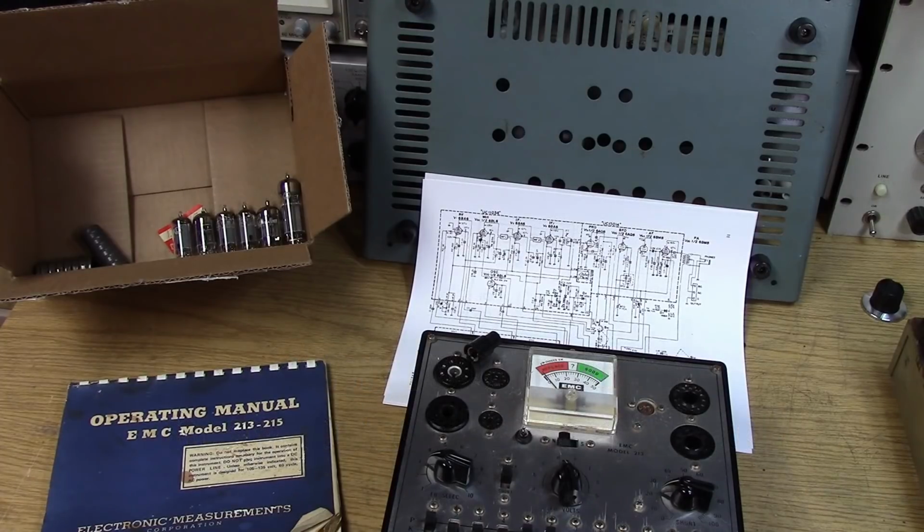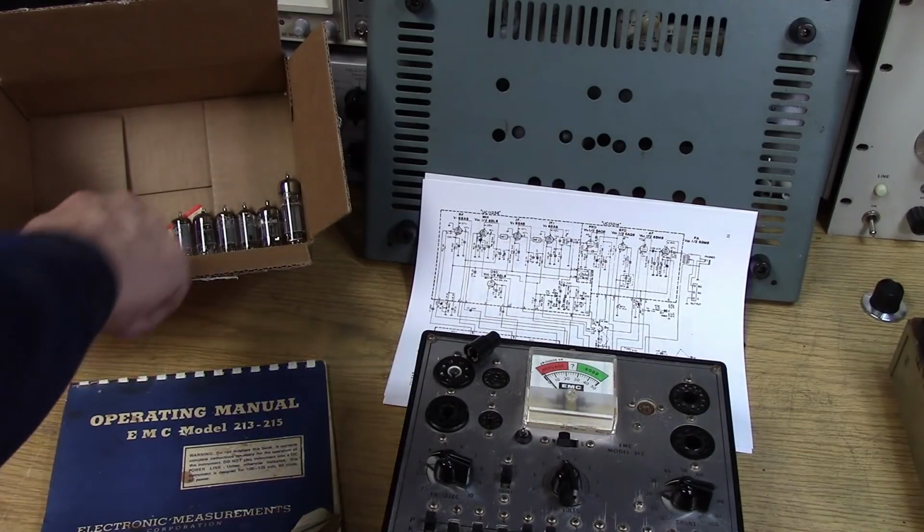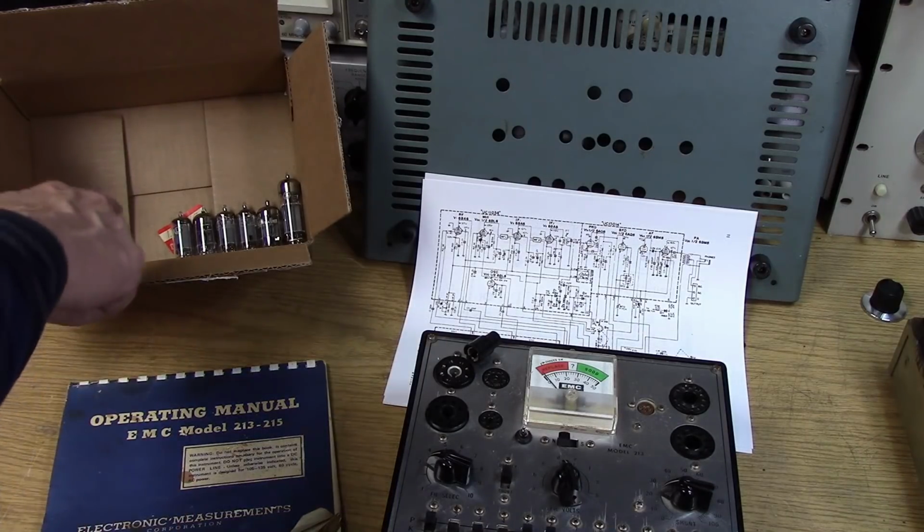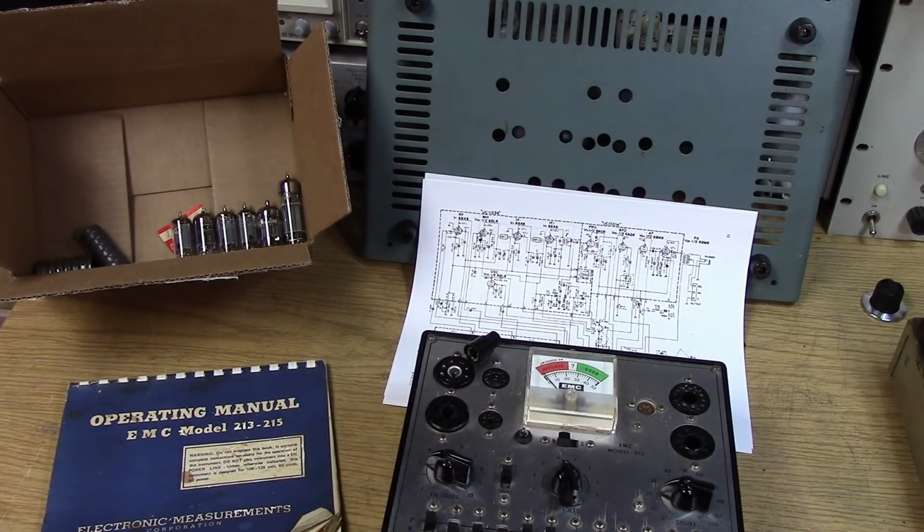But one thing I noticed as we go down the line here, and we have the RF amplifier and the two IFs, are 6BA6. But the 6BL8 frequency changer, which is a mixer and an oscillator, has been substituted by a 6GH8, which is similar to a 6U8.